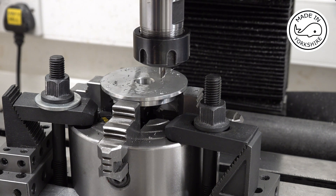The actual holes need to be 0.136 of an inch in diameter but I haven't got a drill bit that size. The closest I've got is 3.5mm so that's the one I'm going to use, but I'll do that off camera.